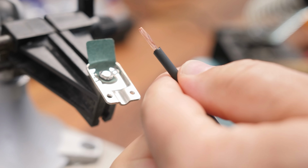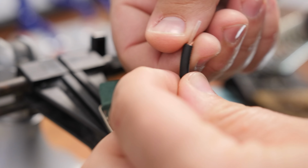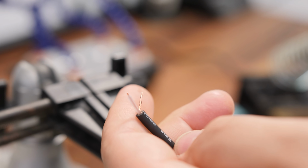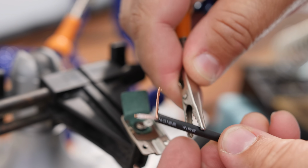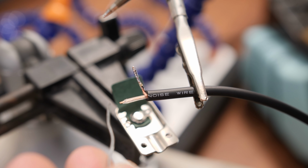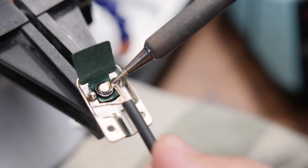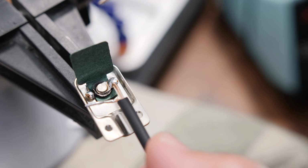They're not going to be in spaces like that, and most people couldn't afford those crimping tools or to keep them calibrated, separately from the investment they have to make in the solderless cable and the solderless connection. The easiest workaround right now, based on the technology available for solderless connections, is in no way superior to what a soldered connection offers. Soldered by far supersedes the quality of the connection, and if you like the cable of your favorite solderless cable manufacturer, please use it, but just make sure you solder it.